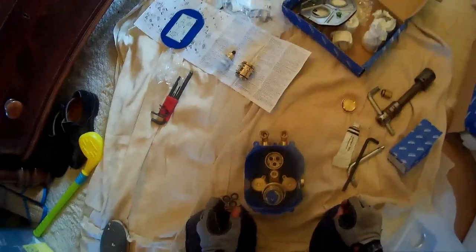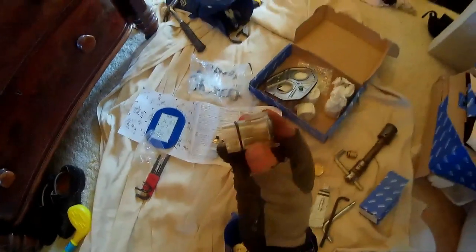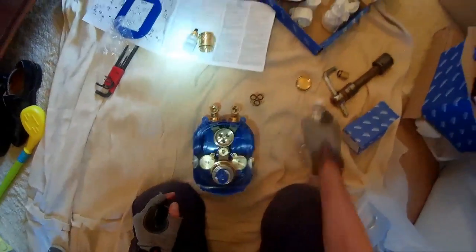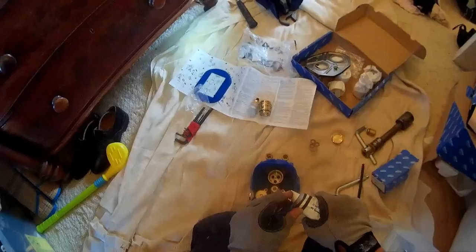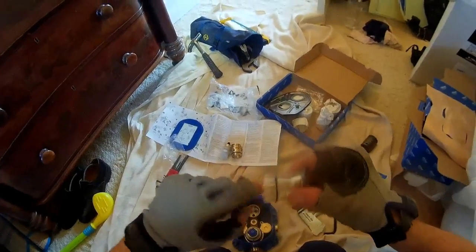Here are the three pieces that correspond to these three in the race — as they refer to it in the instructions. Install race, part A — this is part A, this is the race. We can see these two pins correspond to pin cutouts there and there. Those will have to correspond to those two. Before we go any further, I'm going to pop a little bit of grease just in there — not a lot, you don't want big blobs. You just want to wet these rings here ever so slightly just to help it along. When you're burying it in the wall in cement, you don't want any problems. You should use a silicone-based grease and make sure all the parts are clean and tidy.